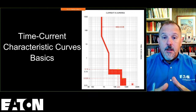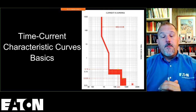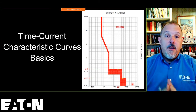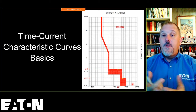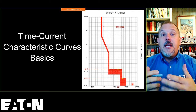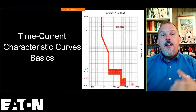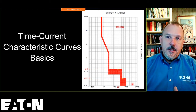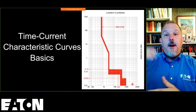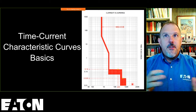The TCC curve, this trip curve for this circuit breaker, is very critical. I call it the resume for circuit breakers, for the overcurrent device. Fuses and circuit breakers will have a time current characteristic curve that tells you how they perform based upon current. The job of the selective coordination engineer is to plot these on a trip curve with upstream and downstream devices to understand how they work